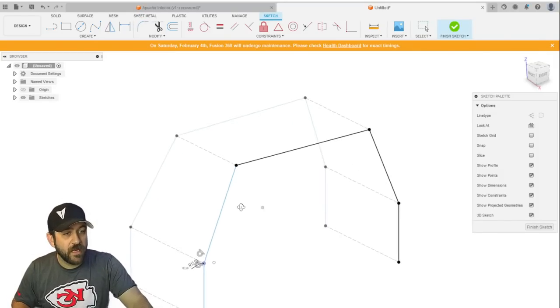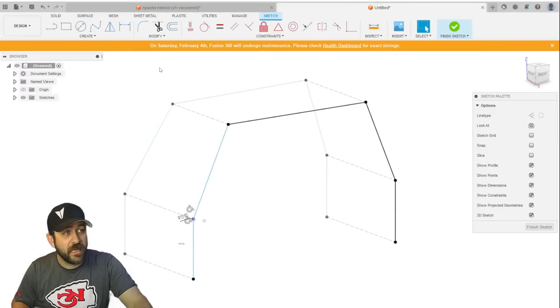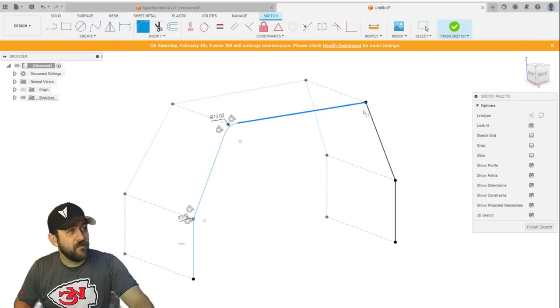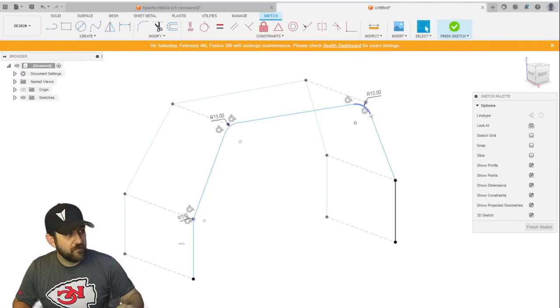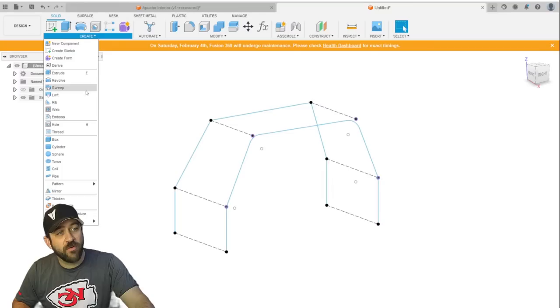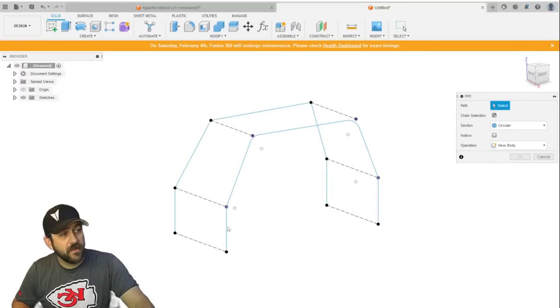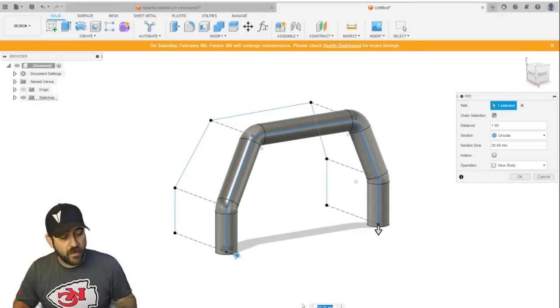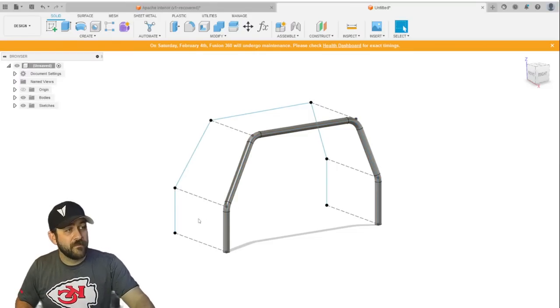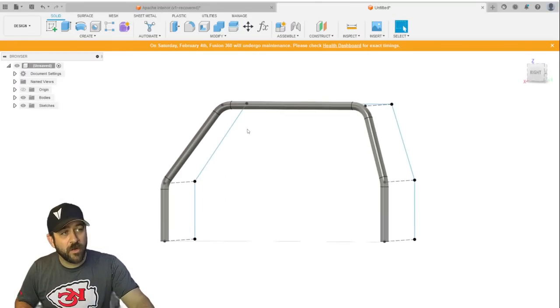So, 3D printed roll cage. Yes, if I'm doing a 3D printed cage, this is exactly how I'll do it. 13 there. Some of them, maybe this one gets bigger, maybe this one's 20. Then you go into create, go down to pipe, select it, 3D printed roll cage, 5 to 6 millimeters. I'll usually do 6. So then I've got my roll bar hoop.